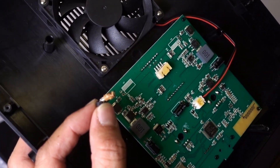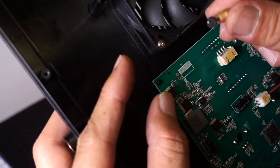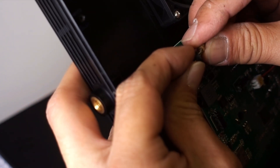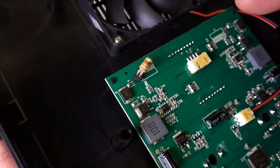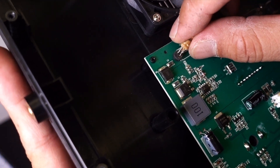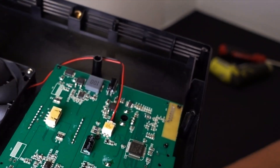I had to use one of the lights, so I took one capacitor from this board to fix the other one. This one still needs repair, but I've already desoldered it and cleaned up the through-hole solder joints so it'll be ready when the replacement part comes in. You just need to desolder the blown capacitor and put a new one on there.